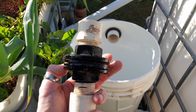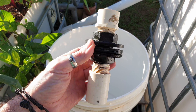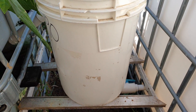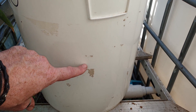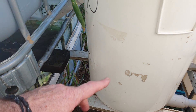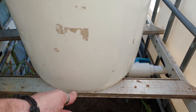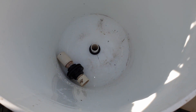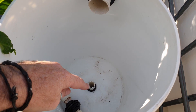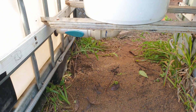You could put in one of these bulkhead fittings, but one of the problems is you also need to buy the corresponding threaded adapters, which can be expensive depending on your budget — it can blow out the budget a bit. Two more things that would need to be added to this drum are a bleed-off valve at about that height to take clean water out of the settler and deposit it back into the sump, and a little port down the bottom with a valve to drain out solids that accumulate in the base. A word of warning: don't force pipe through uniseals in thin plastic — the plastic's not too forgiving.